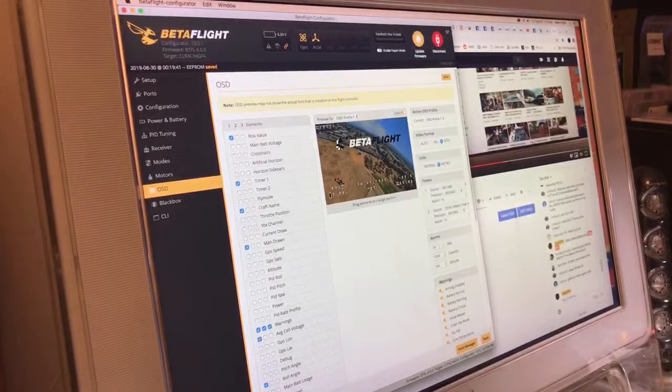Good. I move my RSSI alarm up to 30. Battery capacity is going to be 650 to 850, so we'll err on the lower side. Timers: total armed time is what I like, and I set it for 3 minutes to start flashing. I don't use the second timer, so I don't touch the second one. I don't think this controls anything. TSC, and we're good. Save that.